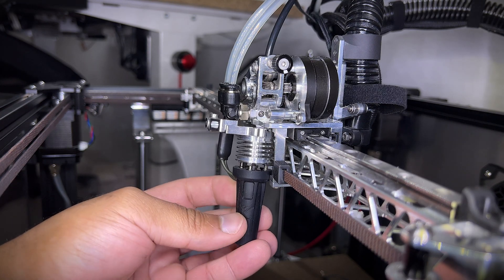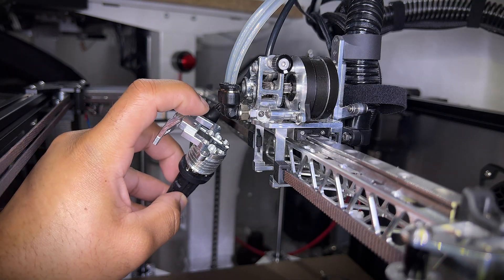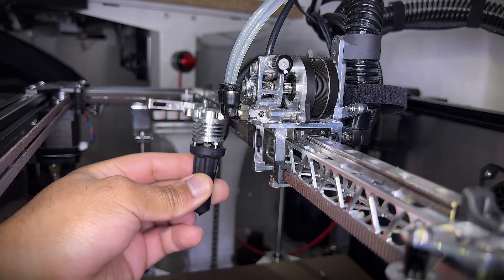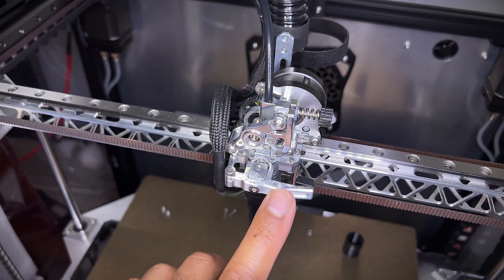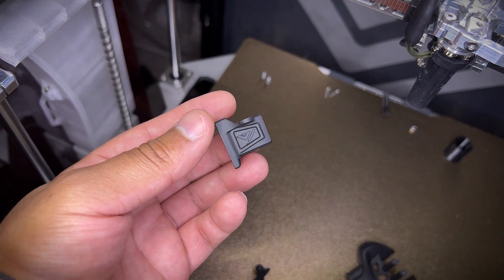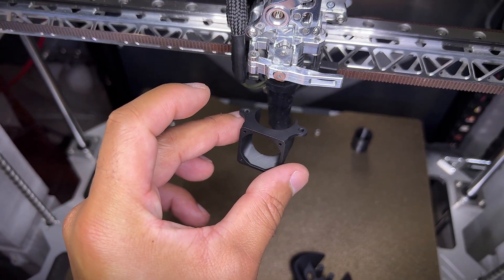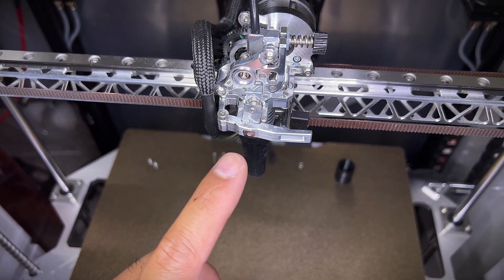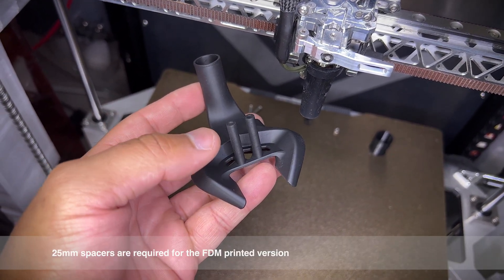I have an issue — I can't mount the Magneto on the tool head because the water cooling fitting is touching this part. That's why I'm going back to the air-cooled version. Now it's perfectly installed, but I could not use the previous hotend fan duct so I had to make it flat on the upper side to fit below the Magneto. Because it adds more thickness on the tool head plate, I also had to print another CPAP duct with longer spacers.